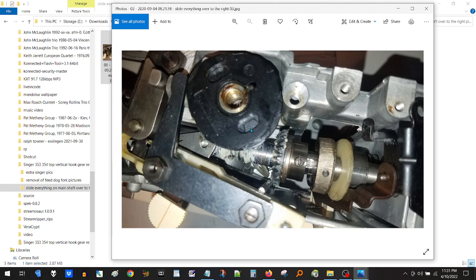and too loose on another part of the revolution. You don't want it to be super tight, so that on the tight part of the revolution, it's going to put stress on the new plastic gear. So if it feels tight and then loose and then tight, undo this set screw and just back this gear away from that gear just ever so slightly, just very slightly. Retighten the screw again, put the hand wheel back on, turn it, and just make sure that there's no play, but that it's not overly tight during one part of the revolution. This is kind of just a feel situation.